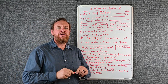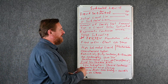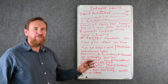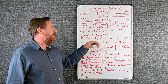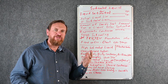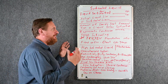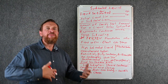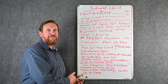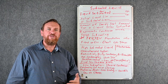Now you can go back and reference this as you learn more things that cause low sub cooling — add those to your notes. Don't be afraid to rewrite your notes and leave room for the fixed orifice sub cooling chart. If you haven't watched the videos on how to find your target sub cooling for a TXV, go back and watch those. Number one: know the answer. Number two: know where to find it. Put some of these in flashcards, test yourself, and be proud of your notes — make them your first reference guide.